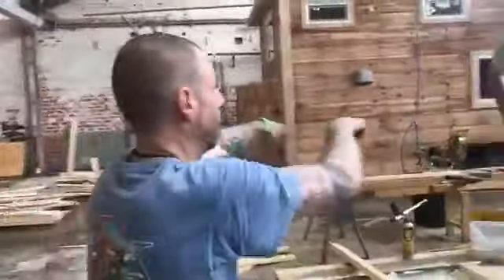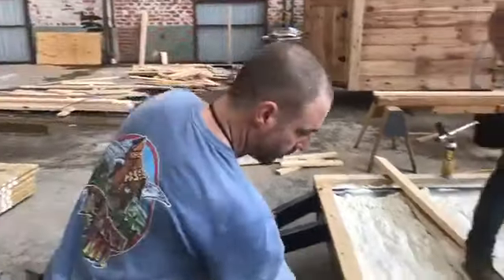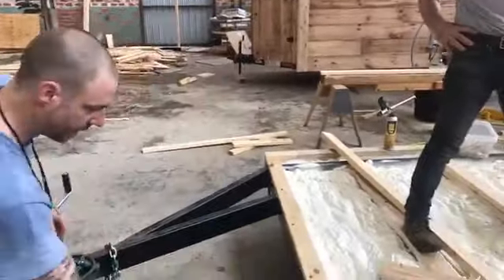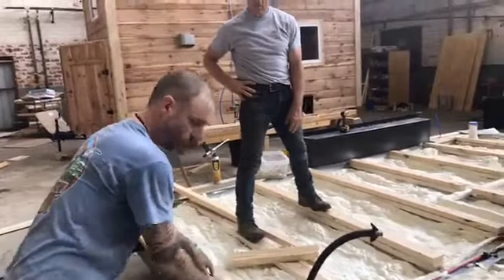Water lines — those are covered over there in the front. Imagine a box like that but half the height — there's going to be a window right over there. It's covered like a three-foot box. On the outside wall of it will be the water heater. So the water line will come in — the blue line is cold, the red line is hot. The water line will come in and go into the water heater. Then if we follow these down, they go all the way down — hot and cold right next to each other.